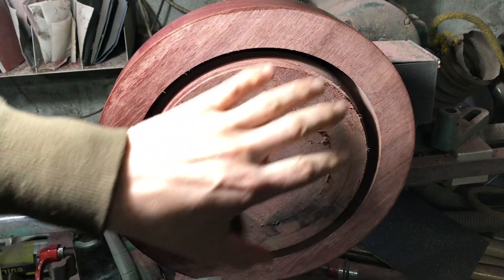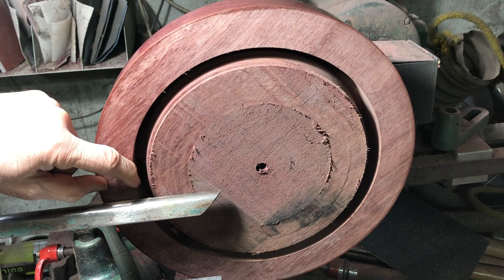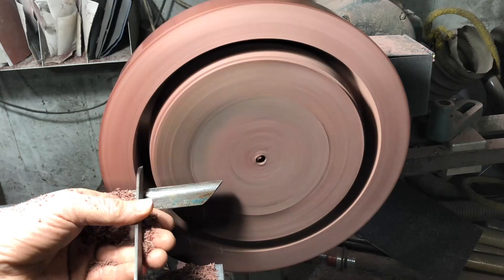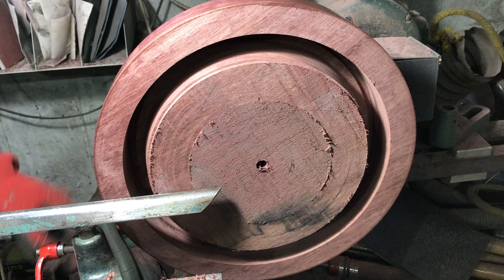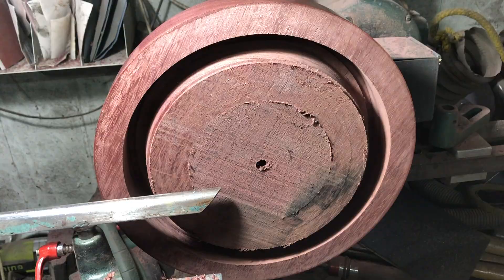This is going to be the bottom part of the eye. Looking at the centre piece, that's going to be the bulk of the eyeball. I think I can get away with a slightly thinner rim on the outside of the bottom of the eye. The top I think I'm going to go with an inch - that currently is an inch and a quarter so I'm going to go slightly smaller, down to about there. The dodgy bit going through - I don't want it knocking on that bottom bar. I'll drill a hole through the last remaining bit, put the jig around and then clean up the edge by hand. I just don't like the prospect of that flying off, and the tool being so deep in there and jerking and ruining all that lovely work I've done on the outside edge. So - jigsaw.